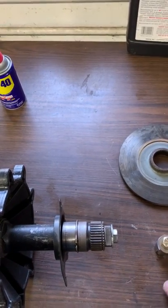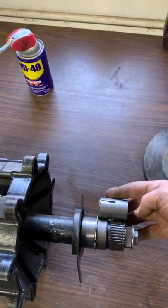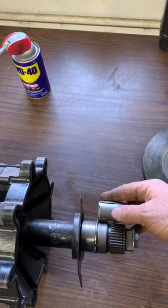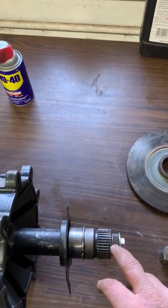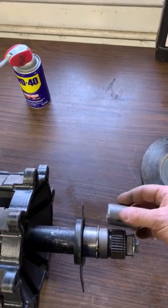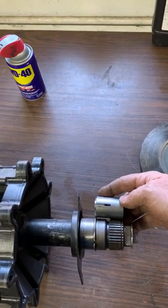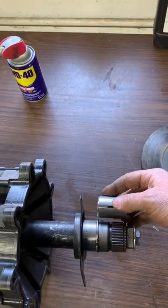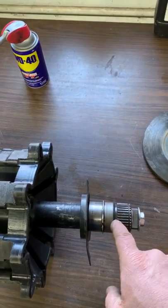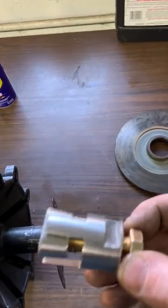When we were originally doing prototypes, the original intention was for this to be flush with the end, and in conversations with the machinist we talked about adding some flats — so the flats were added. But amidst all the variations in this whole process, we kind of missed the fact that we didn't add any additional material to keep this wedge in farther in order to keep any expansion from occurring out on the spline.